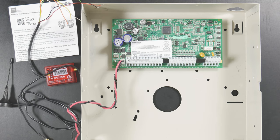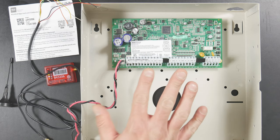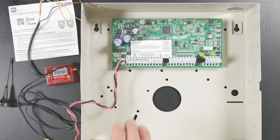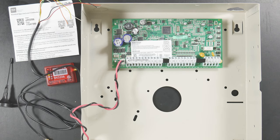We are going to talk about a few things here today on this video. Primarily, we're going to talk about getting your communicator wired into the panel for both non-interactive and interactive services. Prior to getting any of this done, you want to ensure that your security system is actually powered down. You want to make sure that you've disconnected power to both the power supply and the battery. This panel is definitely powered down — it has no power at all.